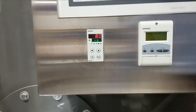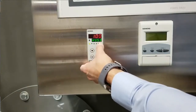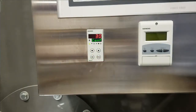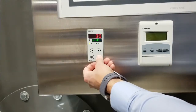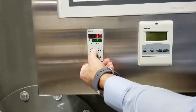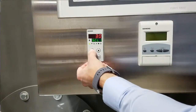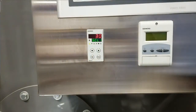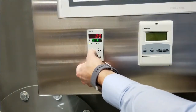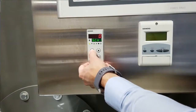While in the parameter menu, also set HYS1 to 0 and HYS3 to 100. Then escape to configure. Hit enter to go to INP, then enter again to INP1. Set sensor 1 to 16. Then set SCL to match the distance between the taps of the working and reference leg — in this case, 20 inches as measured previously. Then set SCL- to 0.